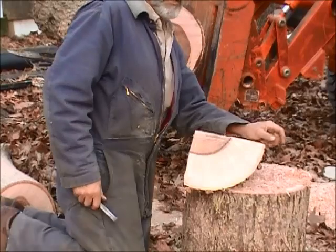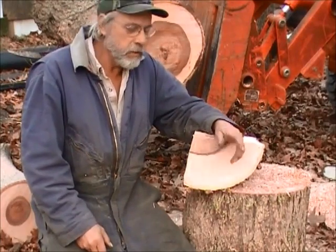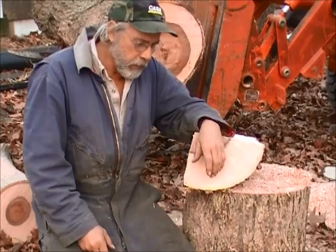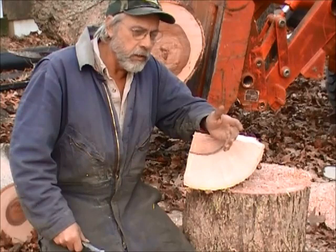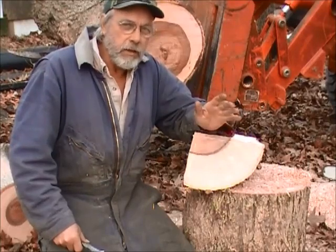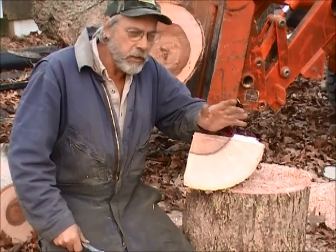The cutter on a chainsaw chain — you've got the side and you've got the top. I originally thought the top was the most important part. Yes it's important, but not as important as the side. Most people, if you don't use a file gauge to keep your file at the right height when filing that tooth, you're going to undercut that cutter — you can't help it. Because the side is so thin versus the top, the file is going to go down to the side unless you hold it upward or use a file gauge. It's almost impossible to file a chain right without something to hold the file up in the air.